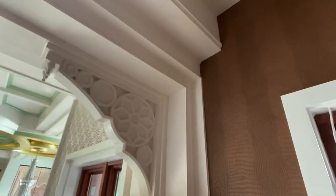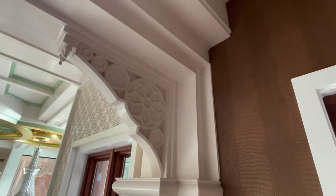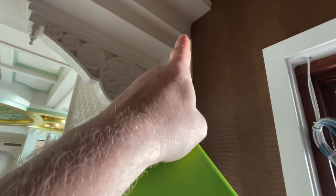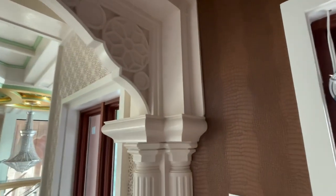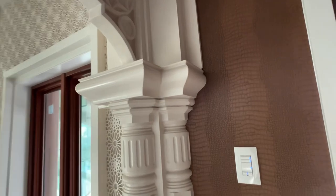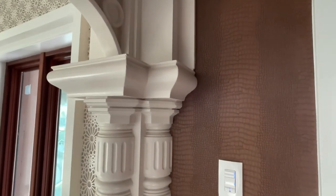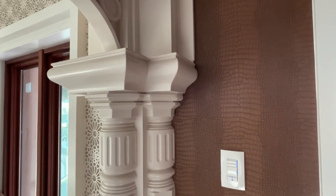And once you begin the vertical descent, you start considering all of the little parts right here that have to be cut. And so we all know how to do that, right? But when you come down to this curve, you have to have scissors. You have to have wallpaper shears, and they have to be sharp.